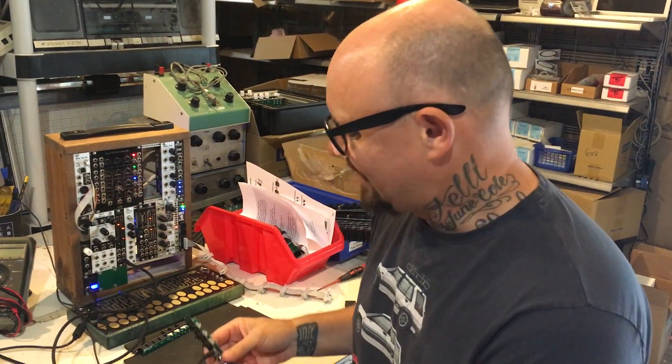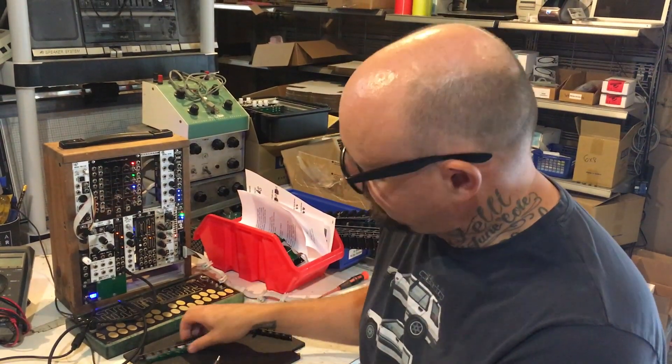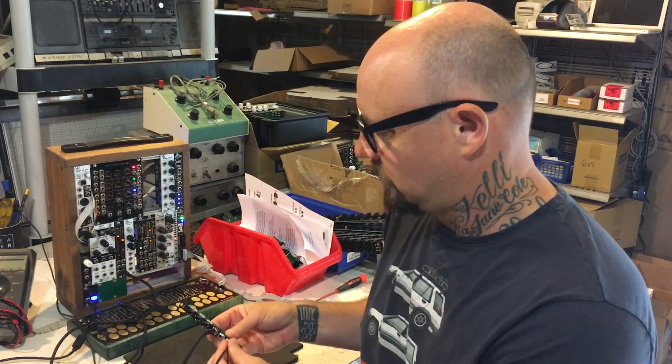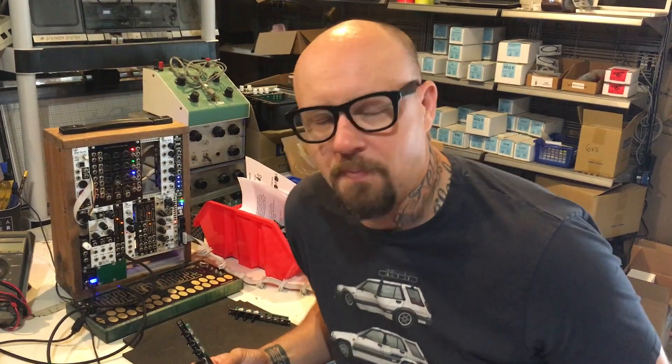The benefit of this way without resistors in series is that you can actually get a hotter signal. It's not like one way is necessarily the right way, but we're moving over to the resistor series because of the lack of interaction. If you need a mixer that will give you more power or be more accurate from your input signal, you probably want to get an active mixer.